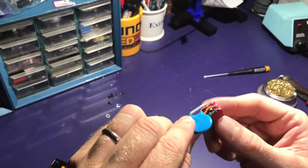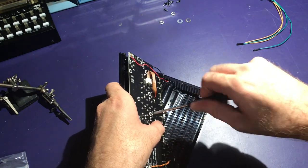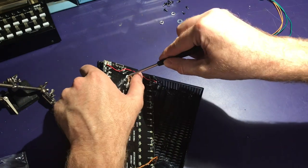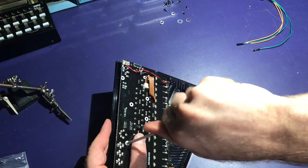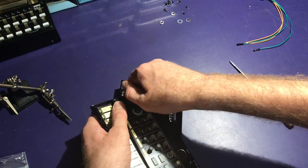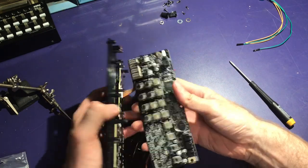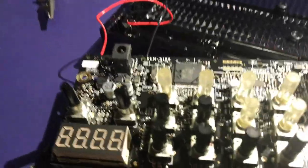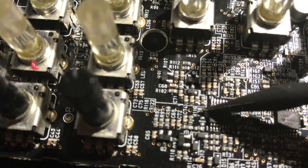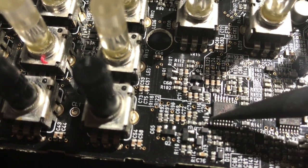Here's the switch with the added capacitor on the side and the leads connected to it. Looking at C78, where we want to connect our snare — it's going to be right there. See that C78? Looks like those two open spots. So that's where I'm going to be connecting my orange wire.